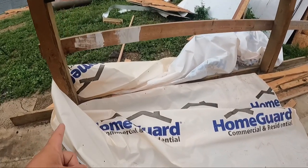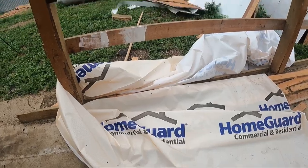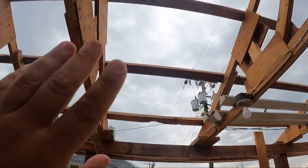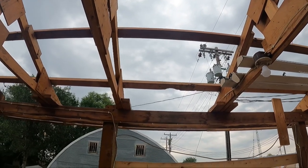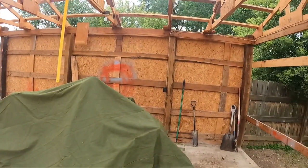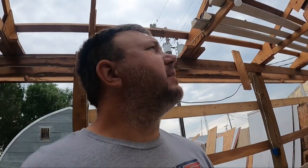Talked to Max, a good friend of mine — they had some roof wrap left over. So I'm just going to put roof wrap from left to right on the purlins, just like you're supposed to. That'll give us something to squirt the foam to, and it won't let the tin stick to it. Some ideas you've got to change along the way. I'm going to call it a wrap on this one. The next video will be me and hopefully somebody else — maybe the wife, I can guilt her into helping me tin — and we'll get her tinned.